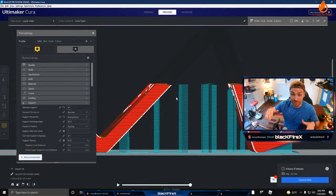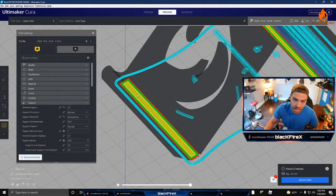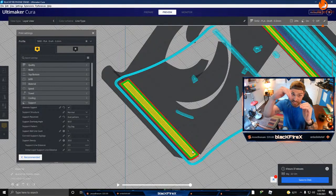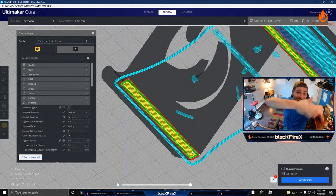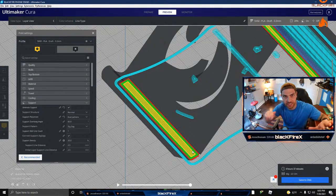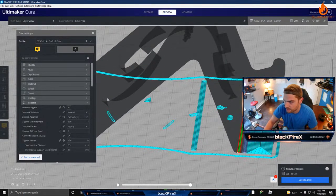It's really easy to notice this if you're doing a wider patch like that, if that was all flat. What that looks like on an angle would be very indicative of how well you have your nozzle positioned from the build plate. Because if you can see humps, it's way too high. You're getting these cylindrical prints coming out, the plastic's coming out like a tube. If it's way too low, you'll see this. At each crease, you'll see these little creases because the nozzle's so low, it's just cutting into it. But if it's almost shining, if there's almost a reflection off of it and you can hardly see the lines, it's perfect. So that's something you look for on a first layer, and at least on the first one, you'd be able to see it.